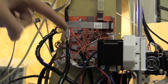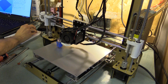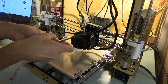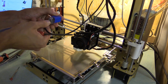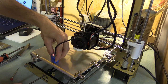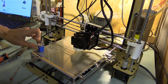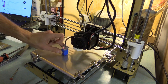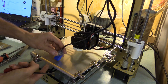To use the bed levelling sensor I had to install Skynet firmware for the controller, but because I'm using borosilicate glass with PEI polyetherimide plastic stuck to it, it's too thick for the sensor to work — so I'll come back to that in another video. I'll link to relevant video sources and forums that helped me during this build. Be aware there are different build versions depending where you look. Please be careful if you decide to buy this printer — you need to read around the subject, as there are essential improvements for both print quality and safety. The main upgrade was using 2.5mm core heat-resistant fiberglass cable for the heatbed and insulated terminals. I'm also planning to use MOSFETs to connect the power supply to the heatbed and extruder heating element. I'm very impressed with the initial print — thanks to Gearbest for sending it out.